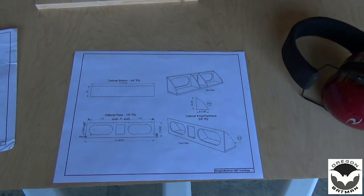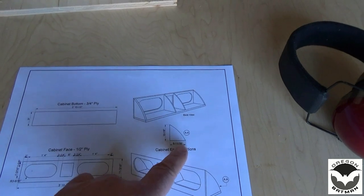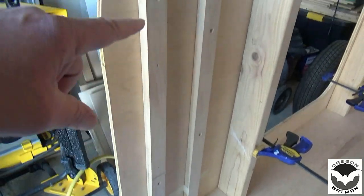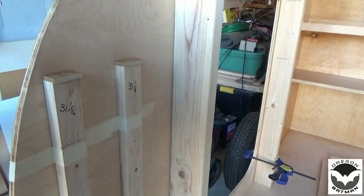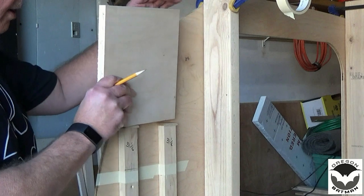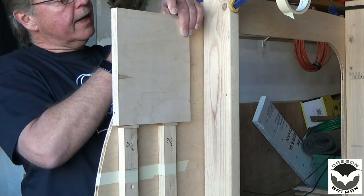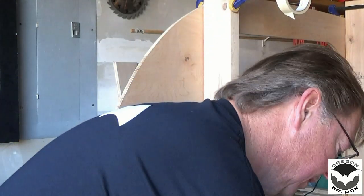Now we're going to start on the front cabinet. First thing we've got to do is cut our pieces for our sides: ten and a half high, eight and eleven-sixteenths inch wide. I've got four blocks cut, and now we're going to set them up and get the shape. I put a couple of sticks on the side - they are thirty-one and one-sixteenth inches high - then we'll set our blocks on top, scribe for our side, and do that for all four pieces. We're going to set our piece of wood up, slide it until the corners are flush with our edges, then scribe a line.